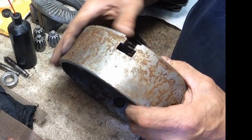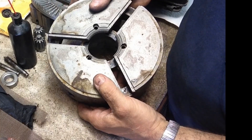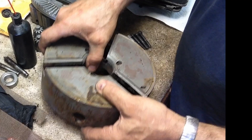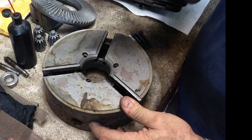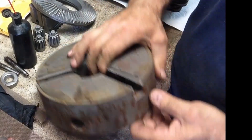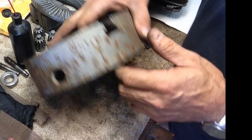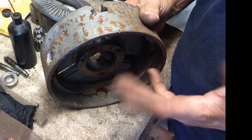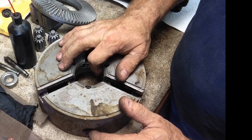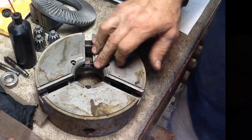I think what I'm going to do, since it was painted before, is go ahead and powder coat them. I'll clean it up a little bit more and then take it to the sandblaster — sandblast the outside surfaces because it immediately flash rusted up again. I've got some of that custom mix bluish-gray I used on the steady rest and follower rest when I redid them, so I'll use that same color here. We'll mask off the surfaces we don't want coated and do all that before assembly.